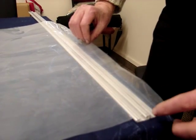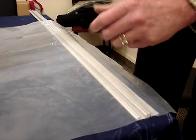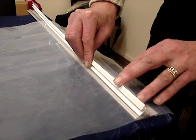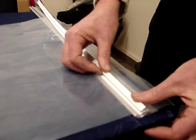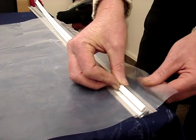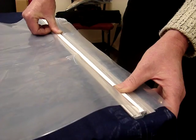You lay the film over it with about 50 to 60 millimeters over the back of the groove, so there's always a little bit to hang on to. Then we bring in the white insert — the long leg faces the film as well. It goes in on a small angle, approximately 30 degrees, to start. We push the insert down and under the front of the lock strip groove. If there's tension on the plastic, you have to let the back tension go so the insert slides in and down, then you continue pushing the insert into the groove along the length of the aluminium channel.